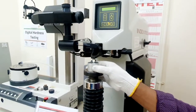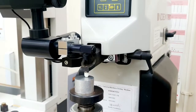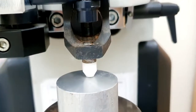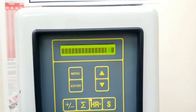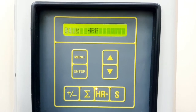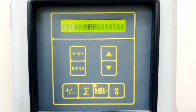We repeat the same for the second position of the aluminum sample in order to have two readings. Once the machine is almost touching the sample, the test starts and the machine calculates the hardness. The hardness value is measured to be 81.0 HRF. We have now measured all three samples.